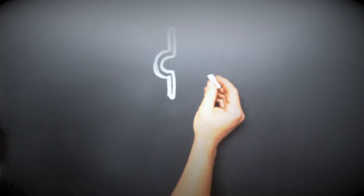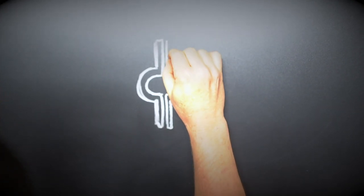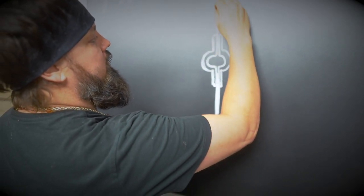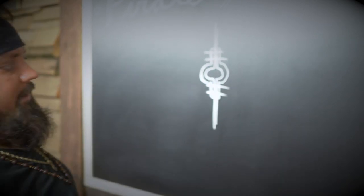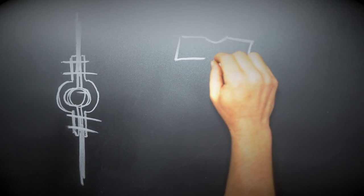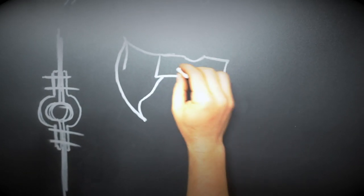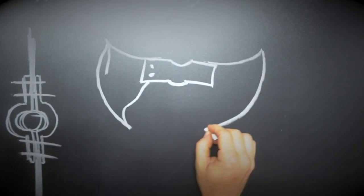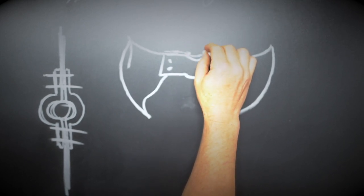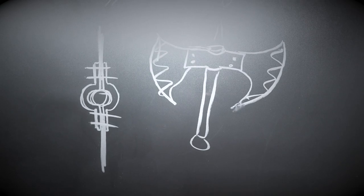So this is one side, and then the other side we'll do the same thing. Two pieces of steel that I'm going to forge into these wrap-around shapes. Then we'll take one bit going in here, the other bit going right here, with rivets through there, and the shaft goes through it like that. So there's the beard of the axe here. It'll get riveted there and the same thing over the other side. There'll be another plate on the back side and the shaft comes through here. Very decorative shaft — we're going to have a little butt piece and a little spike right there. This is going to be Damascus with some squiggly detail. That's it right there.